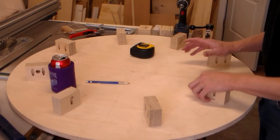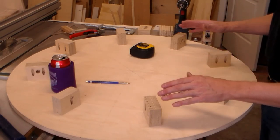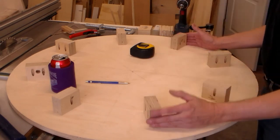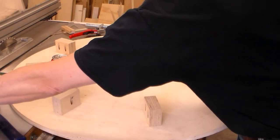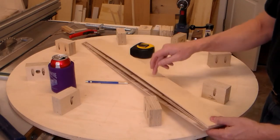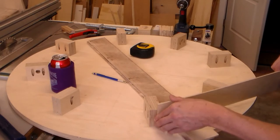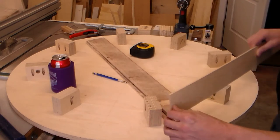So I'm going to need two pieces to get my thickness. I'm going to have to rip it to 3 inch wide and then slice it into those sections like I had done before here, like this. So I'll end up with 4 pieces, like that, and then with my show piece being on the outside like that. So I'm going to have two joints when I get done that I'll have to decoratively cover those. But I think I've got a plan for that.